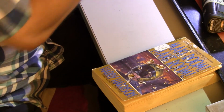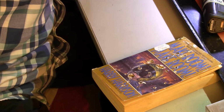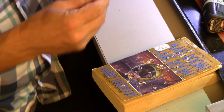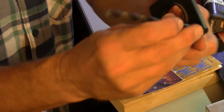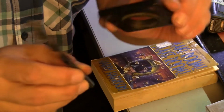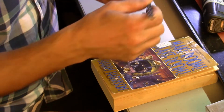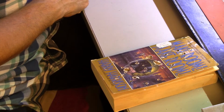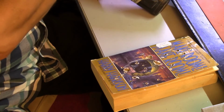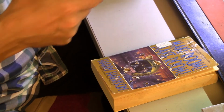Let's see. I should have drilled those with the smaller bit. Okay. It says 19/64. It won't go through. That's big enough. We want the hole behind to be a little bigger. So 19/64 is our guy. But we need to drill starter holes. Anyway, so back to, yes, my 1/8. So we'll drill 1/8 inch starter holes. Watch those chips.